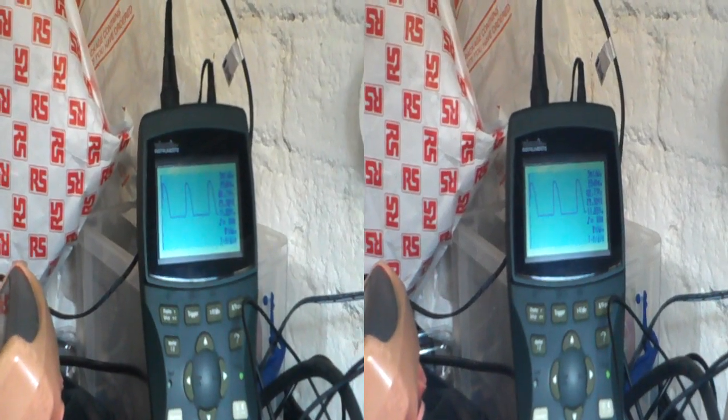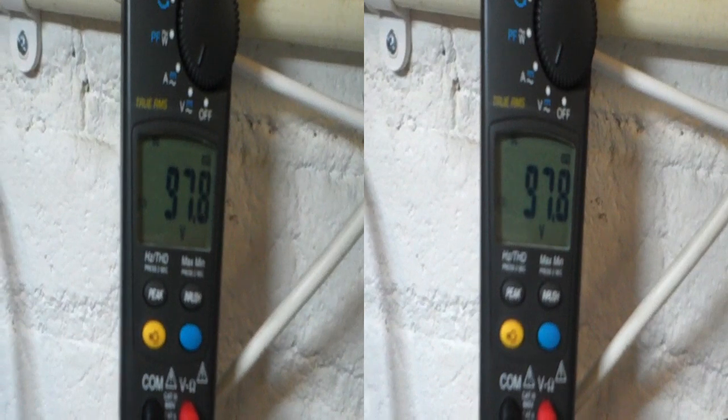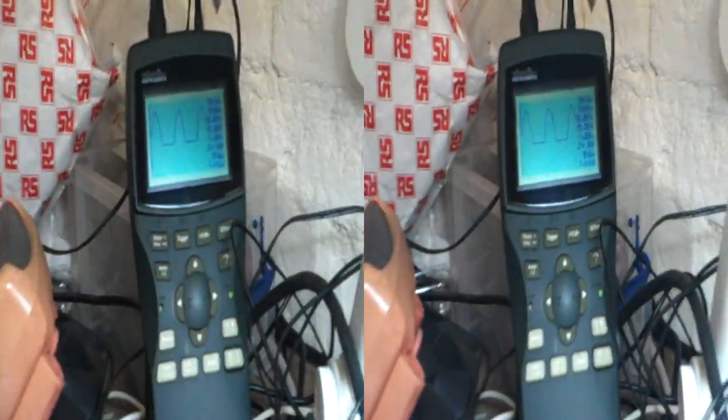It's relying on the mains being stable to trigger it, because the gate circuit is quite sensitive. But once you get above the actual trigger, that's a 50% phase trigger — obviously we're on half phase here. And now we're on about 97, it's relatively stable, the light's a bit brighter. And then I can take it up to what would be 100% of the half wave, and now we've got 106. So that's 100% of a half wave, which is 50% in actual fact. So that works — we've got 106 volts.